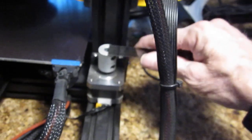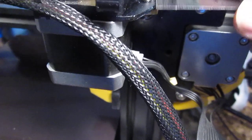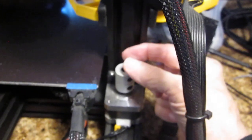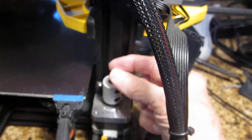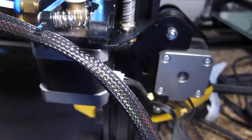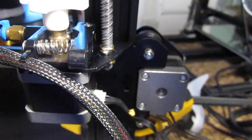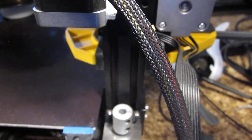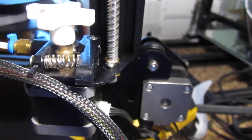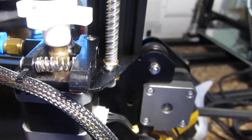The distance from the outside rail to center, and then the distance from the outside here to center, is exactly the same as up here. You can lower this lead screw down, loosen those two screws a little, sort of move it so you feel it's going to be center, and then firm them up. You'll be able to feel that this has a certain amount of play — it stops here, it stops here. So you can feel where it's going to be. When you get the lead screw down at the bottom, see where it stops going this way, going back, going forward. Right here in center is where there's less resistance to the screw — you can feel that.